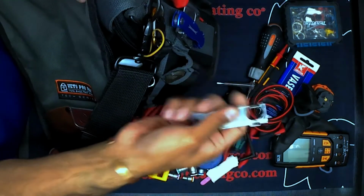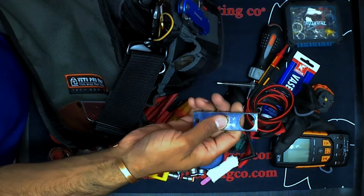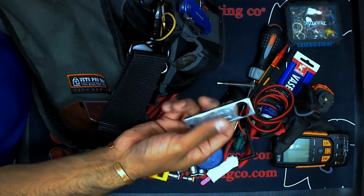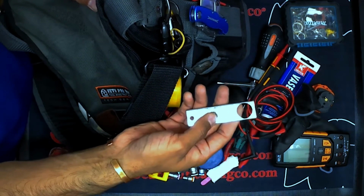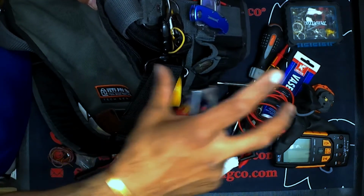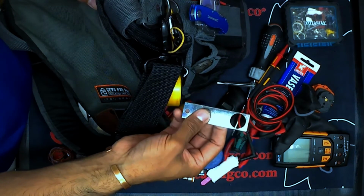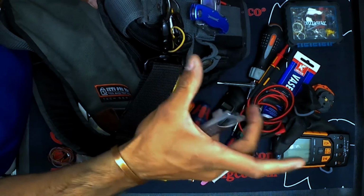I had one in the other bag and I've got one in here. Basically this is for changing diverter valve cartridges. Here in Holland they mainly have Honeywell zone valves, not the kind that you have in the UK, which is the brass body and the metal head. Obviously I used to work on them as well back in the day, with the 5 wires. Here it's different.